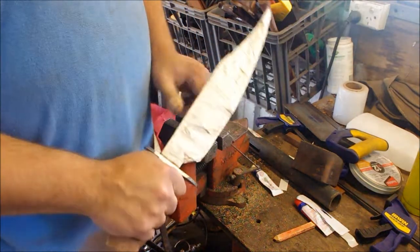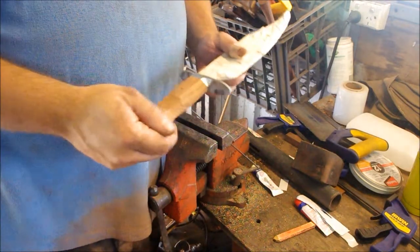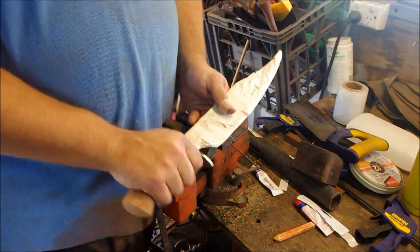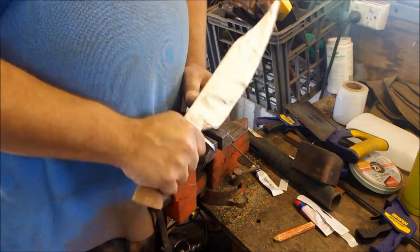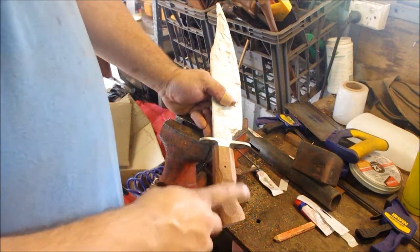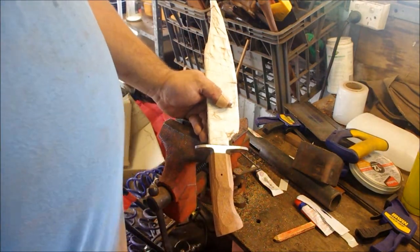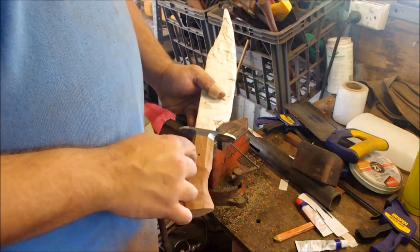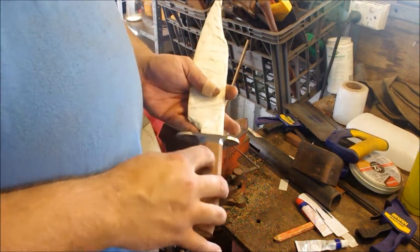And this is something that you learn over making several knives, is that you know what works in your hand. And this specific design, I saw Nick Wheeler doing a version of his Parani project Bowies, where he had a very ergonomic handle similar to this, and I love the feel of this grip. Now it's obviously very rough, and I've still got to refine the shape a lot, and I'm going to be doing that with both the grinder and files, but I've got to put that pin in first. So what I'm going to do is use some epoxy, and off camera, I just opened the tops of the holes just a little bit, and I'll peen the pin in there.